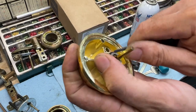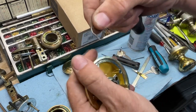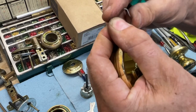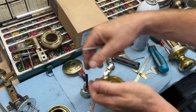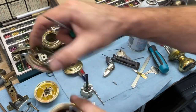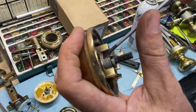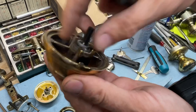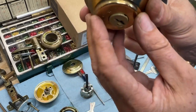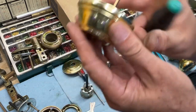Here's the Baldwin — again just Quickset keyway. You can literally look at the keyway and tell; if it were Schlage it would have an angled version. These cylinders are held in with just a little clip that hooks behind some ears. I'll push it up just enough to catch it and pull it off. If it bends, just bend it back — it can tolerate a lot of bending. The cylinder will just poof right out the front just like that.